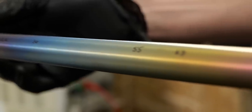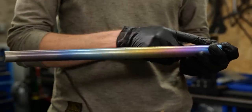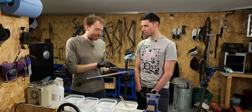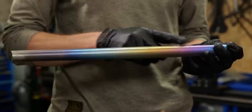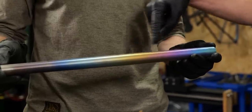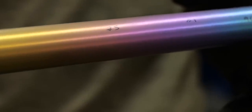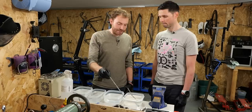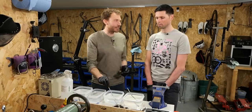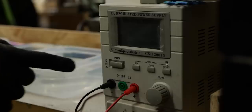That's a pretty good representation of the spectrum of colors you can get from anodizing titanium at different voltages — and you've got them written on as well. We want to start at the lower end because you can only go one way on the scale. As we increase the voltage, the oxide layer gets thicker. If you went for a higher color, you can't then turn the voltage down and reverse it back — you've got to strip it all back off again. I quite like the idea of this pinky-purple color, which means we've got to commit. This tube may be a slightly different alloy and surface finish, so the color won't be exactly the same at that same voltage — we'll have to experiment a little.